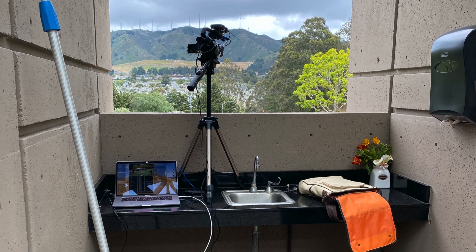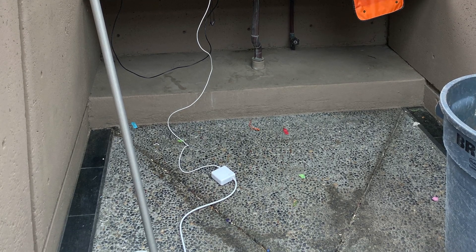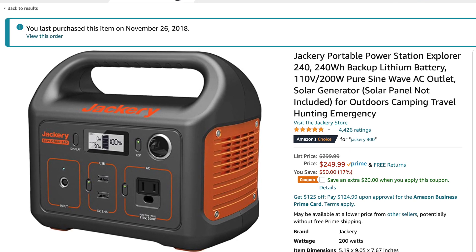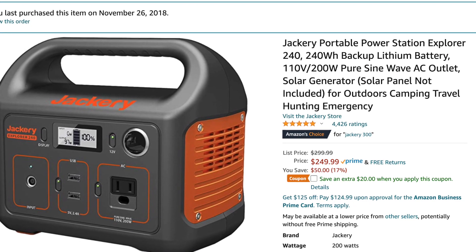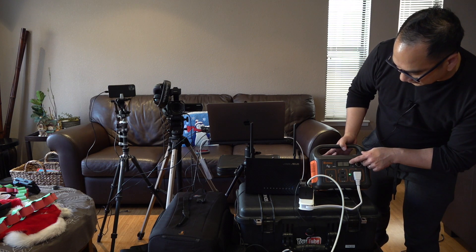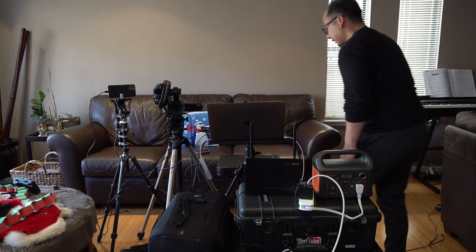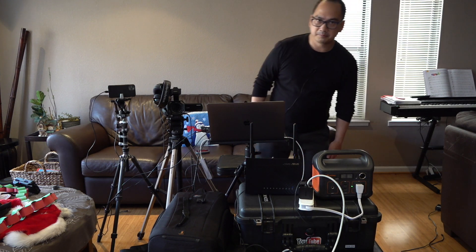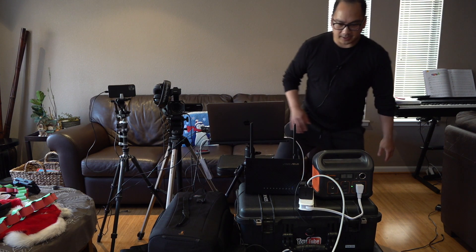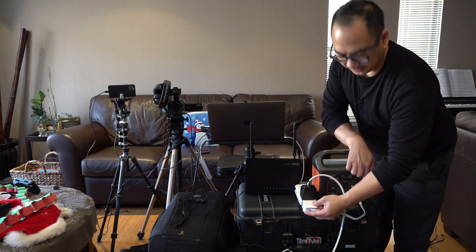So the next option is powering your devices. I have a Jackery battery pack — I'll put the model in the description. Let's go ahead and power that on. I'm currently drawing right now — it says 0 watts, but I just turned it on. I'm at 86%, and I'm currently drawing 70 watts. Now it's going up to 90 because the fan just kicked on on the Mac, and it's at 93 watts. So if you have 300 watt hours, that's going to run you for three hours — you just divide the wattage that you're using by the total output of the battery. The next thing I have is this portable F3 USB charging dock, and it has two power outlets because the Jackery only has one.